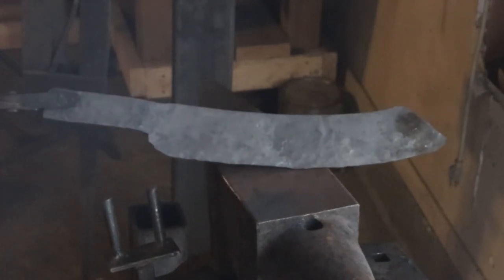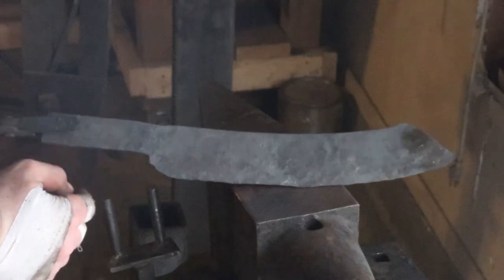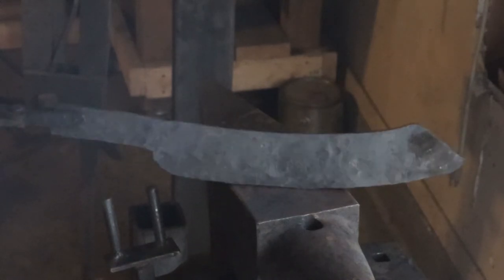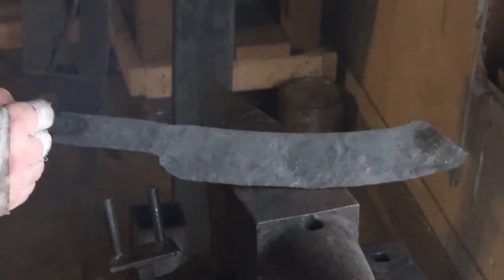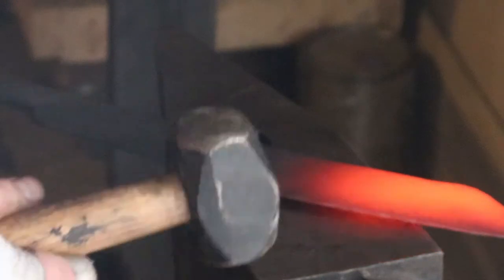You can see it's starting to banana. When I forge this back, I don't actually want a super discernible line where the bevel begins, so I'm going to forge back a little bit on the spine. This will draw the blade out longer and also help correct some of that banana shape. But if you look at the historical examples, these were curved knives — they looked like they got banana while hammering in the bevels and just left it that way, so I want to keep a little bit of that. I don't want to get the blade super hot during this part; I want to forge at colder temperatures because I'm not trying to move the steel very much, just trying to get everything presentable.